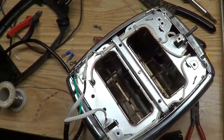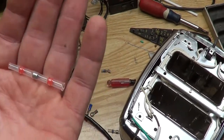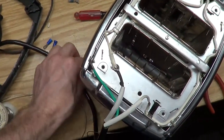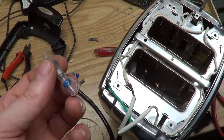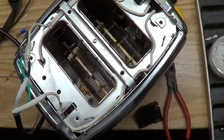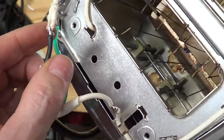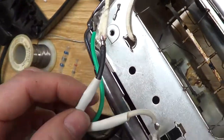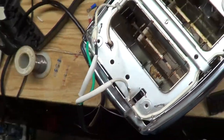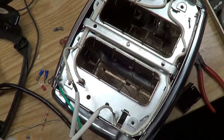Well, unfortunately I went with the tried-and-true method. I think if I would have had the right size of these connectors it could have worked, but these are just a little bit too small. I tried my damnedest to push them on there, but they wouldn't go. And this size was just a little bit too big. I like the good old solder method — I know it's not going to come unhooked. You make a good solder joint, it's good. Then you just put a little sleeve over it. I've done this for 20 years. I don't like butt connectors, I don't like crimping. The good old solder joint is the best — I've never had that come apart.